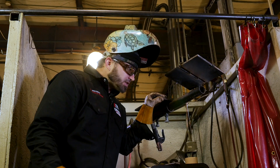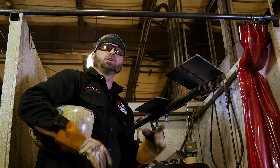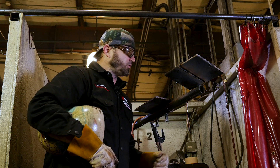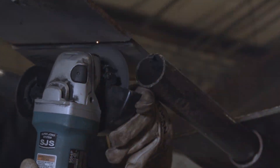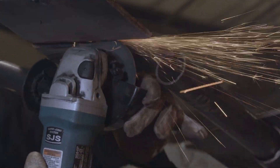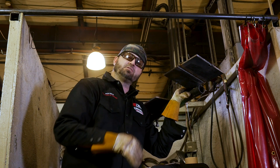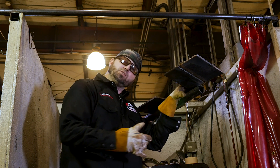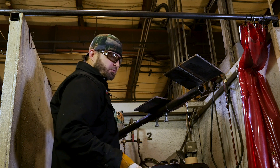Now what we're going to do is come back with our grinder, clean all this up and get it all nice and shiny, then come back and put our fill and cap on. We got a couple of beads in there and a few welds, and we'll be able to put a nice cap on. So watch — here we go. Now we've got it all ground down and cleaned up, got all of our little high spots down.